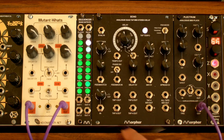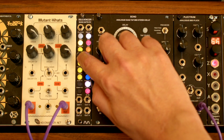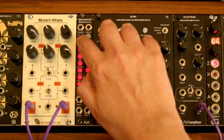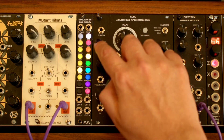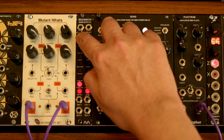Including the green track 2. Back to the track mode menu, select two gate plus CV tracks. Going back to the track select menu, we see two tracks: red and blue. Each has a bright gate channel and a dimmer CV channel. You can even configure the sequencer to be a single track with one gate and three CVs — this is useful for doing chords.